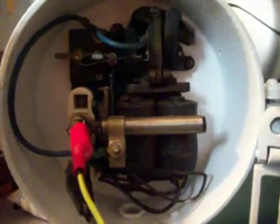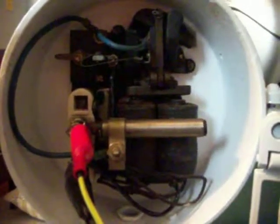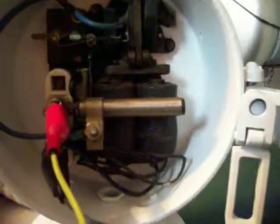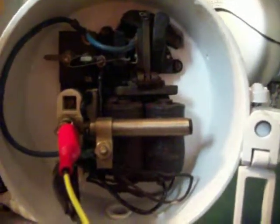They put a spacer washer behind the gong because there was a dent in the gong. There's just so many things wrong with it — this thing would just make a hard clunk and hit here, and it wouldn't actually hit the gong, so you'd have to turn the power way up and it would beat the heck out of the bell.